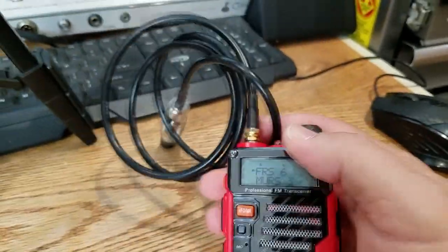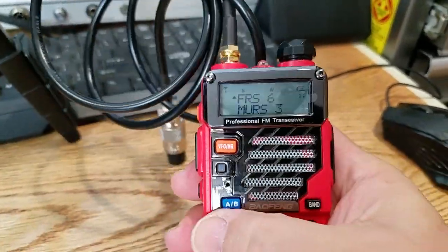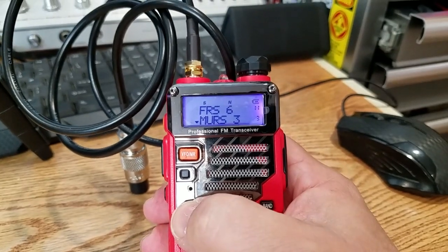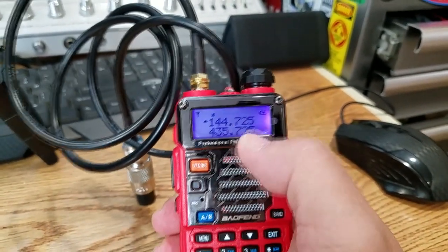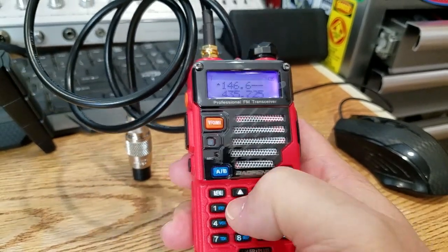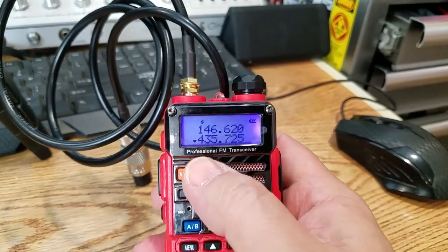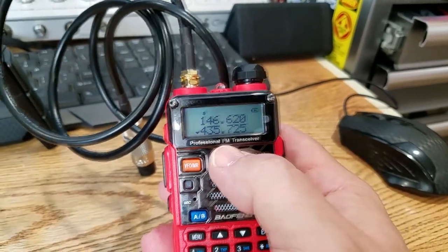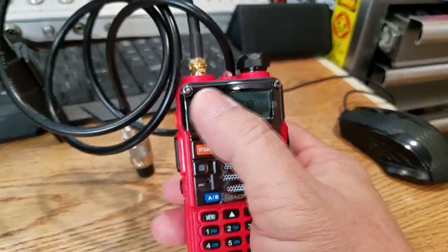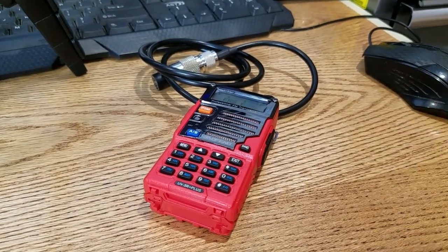We are ready to go — just put in the antenna. But we wouldn't do that because we are in America and that is illegal. So here's what we do: we can receive on these frequencies till the cows come home — that's great. The next thing we can do is be all legal — frequency mode. You can just go and punch in your local repeaters, set your offsets. Now we have two meters. We can go down to 440, 70 centimeters — punch in your desired frequency and legally transmit in the U.S. amateur band. Please leave questions or comments down below. If you have not subscribed, please consider doing so. Thank you very much.